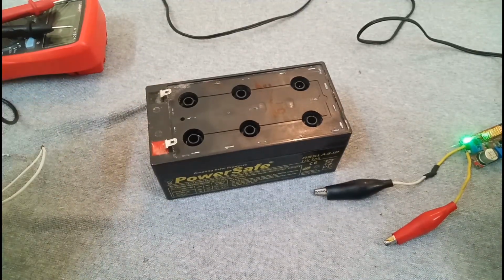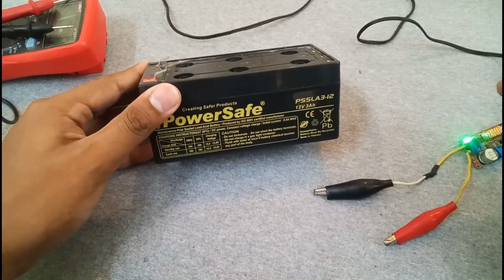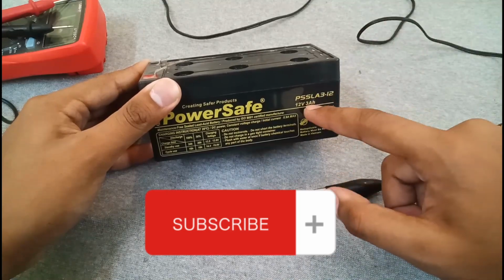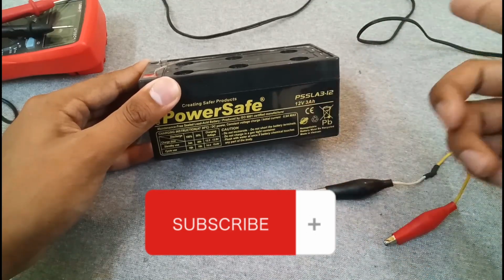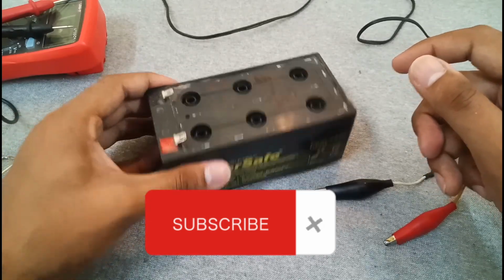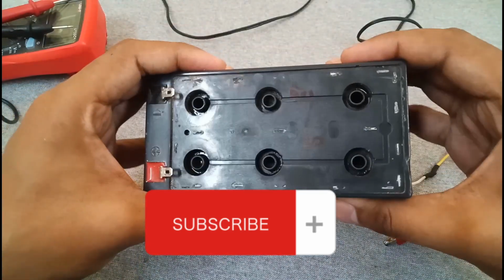And one thing is that it will not be restored to its 100% original capacity. If it's 3 amp hours, it will give about 2 amp hours or 1.5. It will not be restored to its original capacity, but still you can use this battery.